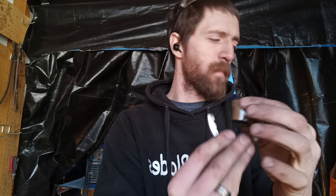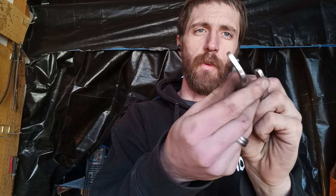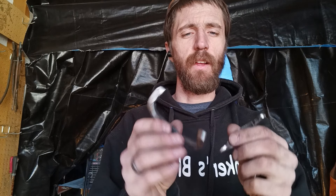So we've got our grooves extended down to that line and we've also brought them up towards the center for that crown. Now I'm just gonna go over to the belt sander and polish this up a little bit more. Now we've gone ahead and gotten those all polished back up, all shined back up for our little crown. It's gonna seat itself right here on top of these horse heads at the end of the tang. Then I'm gonna split that tang with a grinder and loop it back around to form a semicircular shape on the base. Right now I'm gonna stick the horse heads back in the forge and put some detail work on them — give them some facial features — and then hit them on the grinder and the Dremel tool again to get them all polished up and looking good.